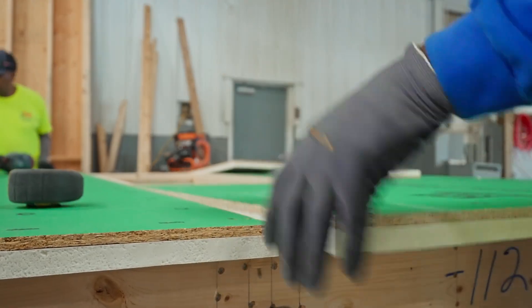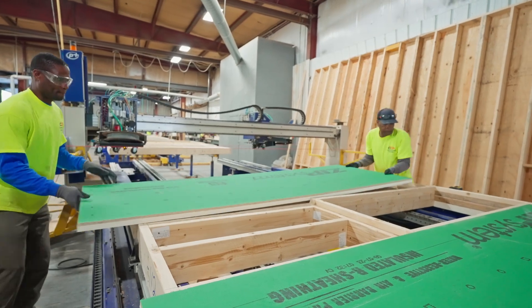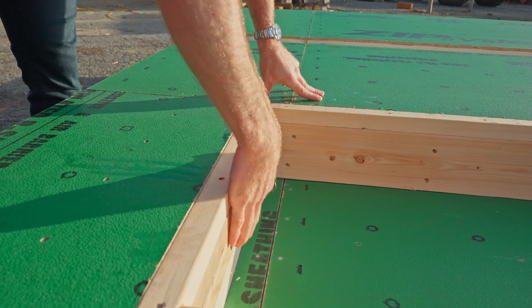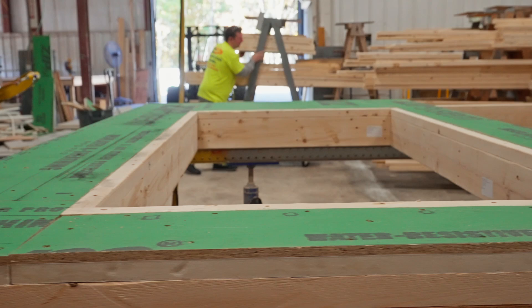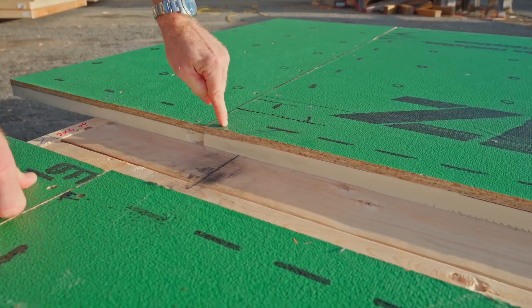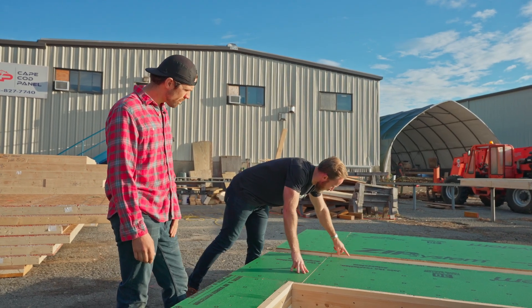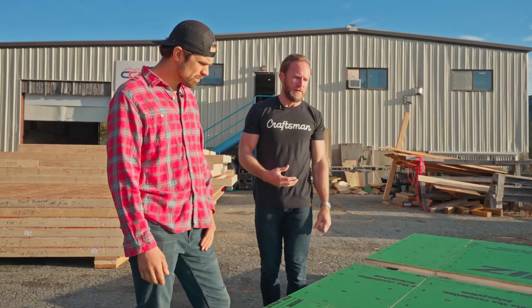On all of these panels, the exterior sheathing and the insulation is left back from the rough opening, and then they install a window box in there, tying it to the framing so the window actually has structure to mount to. If you look over here, you can actually see the foam behind the sheathing panel. If you were installing that nailing fin and nailing through that foam, you're going to end up crushing it and not give the window a solid detail.